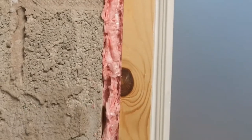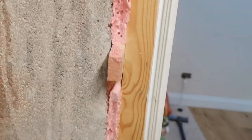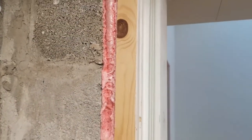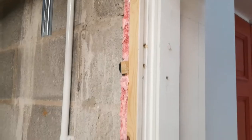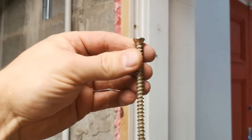Before backfilling with the B1 fire rated insulation foam - this reduces the draft, reduces the thermal bridging of heat going out and cold coming in, and it also has acoustic properties. Frame fixing screws - highly recommend them.